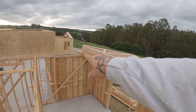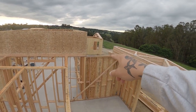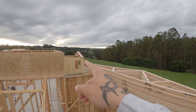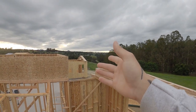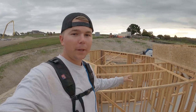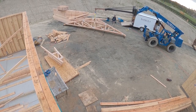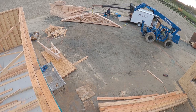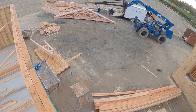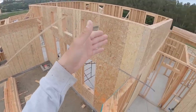You can see we laid these on their sides, and that's because none of those over there have tails — those all hang around to the building, so they are not long enough to land on that plate. So we laid them on their sides. Those little ones over there, it's a cakewalk — you just throw them up, they sit just like that. Since they're banded together, they don't move. We'll get all the trusses up here on the great room. The only thing we'll keep down is the minor fill, the small stuff. So you can see how our hip is going to work out — the truss hooked around at the top has an opening for our hips to go into on both sides, and then the last two trusses are for the hips to run through.